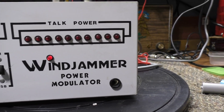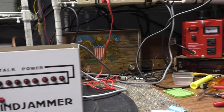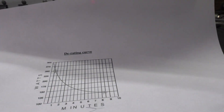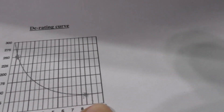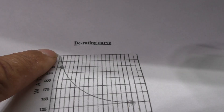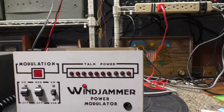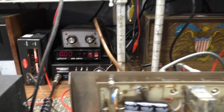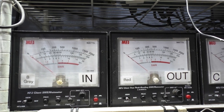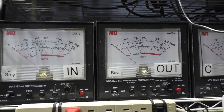You turn it up and it will do the watts, but I've got my little dummy load curve right here. People ask me all the time — can I do more watts, can I drive it more? Think of this curve: if you want the thing to last, you stay in the recommended range. Sure, it will go up the curve for a minute, but it won't last long before you blow it up. Here's the little modulator with a little Mud Duck radio behind it — two watt meters: the one on the left shows watts going into it from the radio, the one on the right is on a peak 200-watt scale.